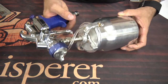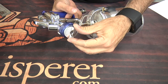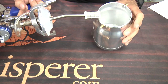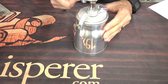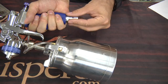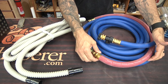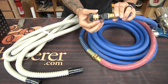Let's take a look at Fuji's gun — this is a fairly high-end unit. Lots of metal, looks really well-made. We've got a simple flow control knob, very similar to the other gun, and the ability to change the orientation of the fan. But we have an additional setting: this little knob allows us to change the pattern — from a wide spray pattern down to something very narrow for tight places. Stainless steel, metal cup, metal parts for the siphon assembly. The hose connects at the bottom under your hand, so we don't have the problem of it blocking the flow control knob. The Fuji hose is a nice rubber durable hose with quality connections and add-ons for extra durability. You can run this over with your truck and it'll be fine. There's also an extra regulator for even more control over airflow.